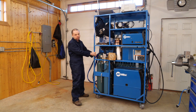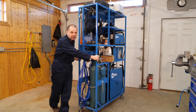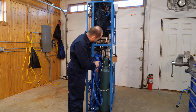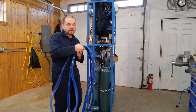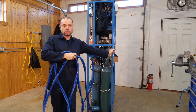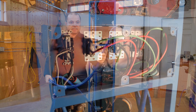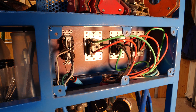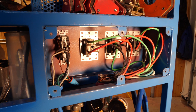This is the space where I can put cylinders in and out, and here is my long extension cord. This cord allows me to wheel the cart to any location in the shop. It's actually two extension cords taped together — 240V for the welders and 115V for the water cooler and tungsten grinder.